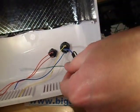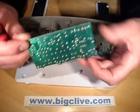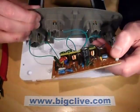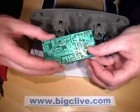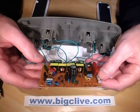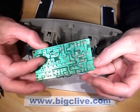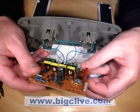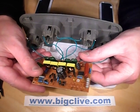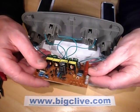Live came in, into the fuse holder, and green coming back out. Green's not really a good choice for the live. The lamp holders are all just moulded in, which saves money. The timing circuitry goes from live through a resistor, then a capacitive dropper, then there's a zener, feeding a capacitor referenced to neutral. So that's a capacitive dropper referenced to one side of the mains supply.